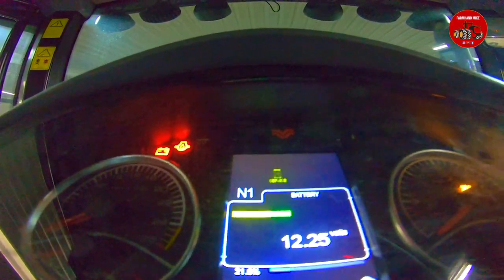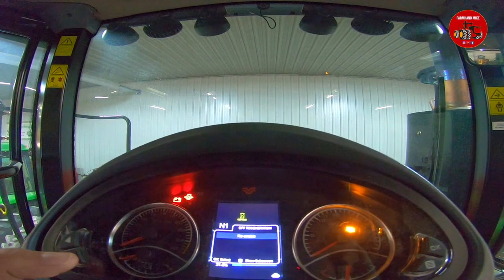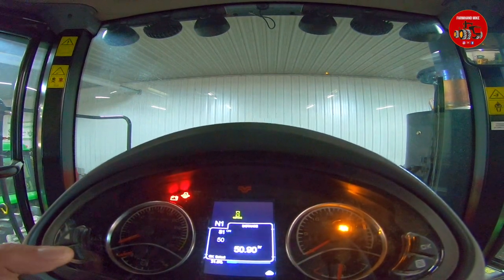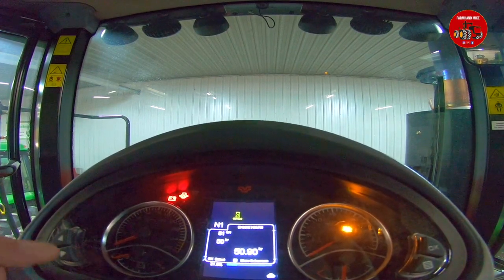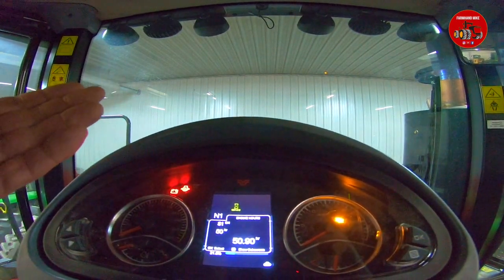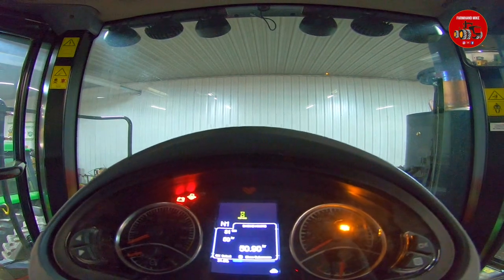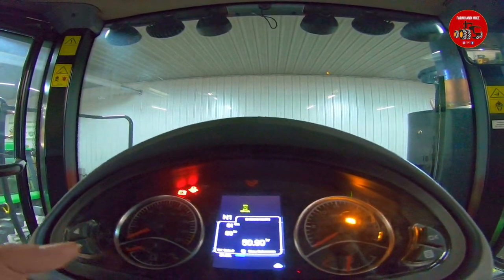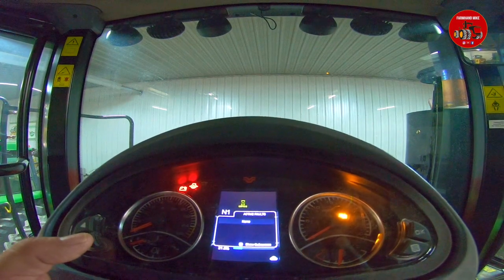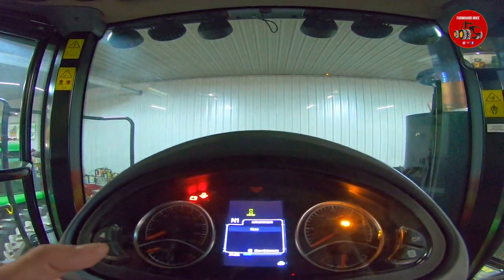Track tension is an option on Delta Tracks. Scrolling through our screen: transmission oil temperature, software, DPF regeneration, calibration screen for different things, distance monitor, engine hours. This tractor has 50.90 hours on it and was set for a 50-hour service — that's why the service light is on. You've got two service intervals you can set. When you change your oil, you can reset it. Say you want to change your oil every 250 hours — set 250 in here and when you reach that, the service light will come on. If we had the PTO, we could also watch PTO speed here. There are no fault codes in the system, but you can look at them here — if you had a fault code, a book icon would appear on screen.